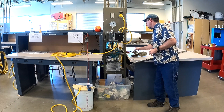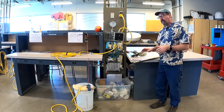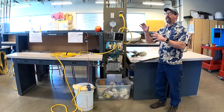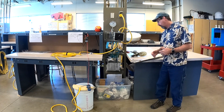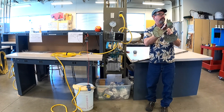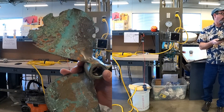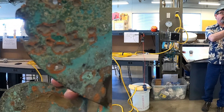The next thing is stray current corrosion. Stray current is where DC battery power somehow inadvertently gets into a vessel, and it interacts with itself or another vessel. In less than two weeks, we destroyed this propeller — my friend Kevin on his boat.